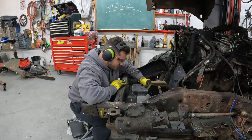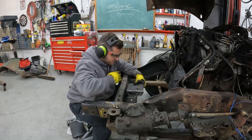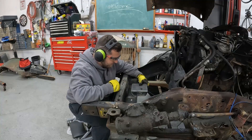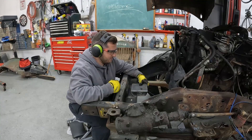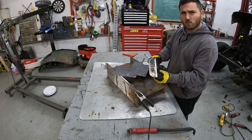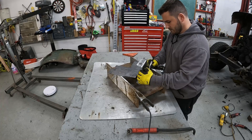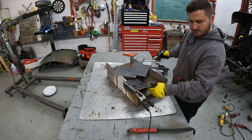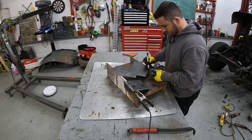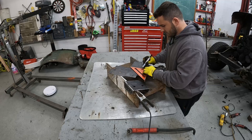So now we want to slide that back. I might drill new holes, weld these holes solid, and I might extend this plate as well. We're just going to extend it out — no big deal. We got to extend this piece about four inches. First, make a little curve so we can attach it. Four inches is a little longer than I need it, but that'll do it — we can always cut it shorter later.